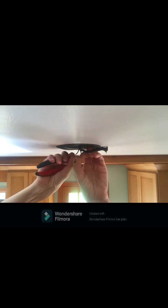Next, I'll use sturdy clippers to clip the wires to the old socket very close to the socket piece so that I will have as much wire as possible for making the connection to the new socket. There will likely be a metal braided sleeving surrounding and protecting the electrical wires. You may need to trim some of this sleeving back to expose at least one inch of wire.